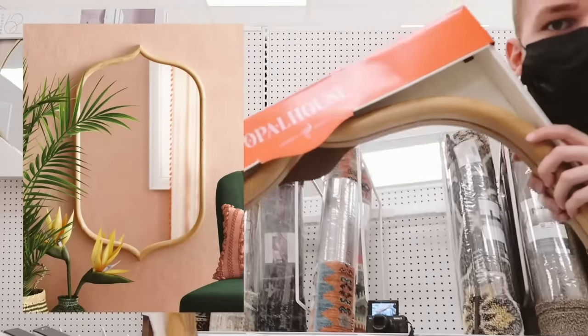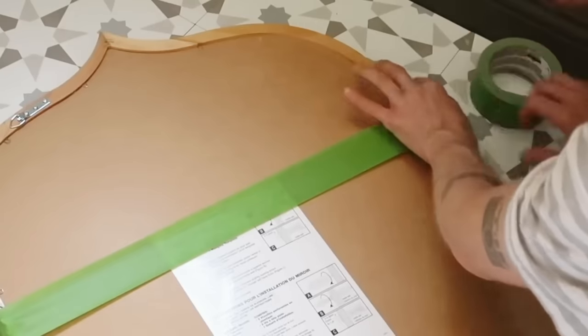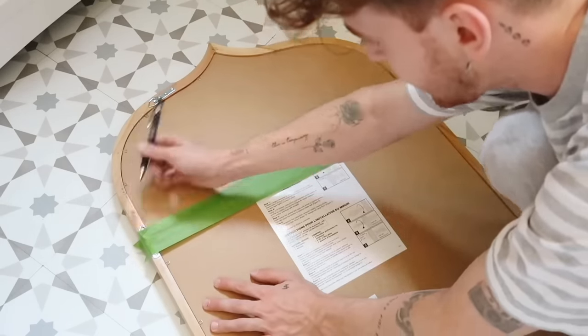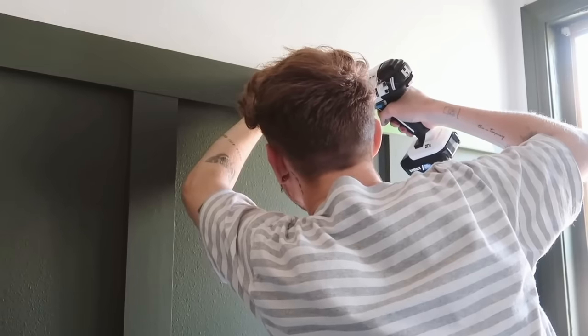Moving into our second tip: this is all about hanging photos that have two hangers on each side. Those are the most annoying — you buy a mirror, you want one nail hole in the middle, but you get home and there are two picture hangers on the left and right side. It's so challenging because they have to be perfectly level; if you nail one higher than the other, it's going to hang crooked. I ran across a TikTok of somebody using painters tape to hang up these photos, and I thought that was the most genius idea. You grab a piece of painters tape long enough to stretch from picture hanger to picture hanger, lay it across, and mark where you want your two nails to go. Then transfer that tape to the wall, make sure it's level using a laser level or a regular level.